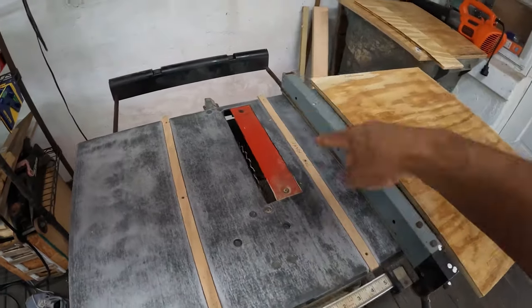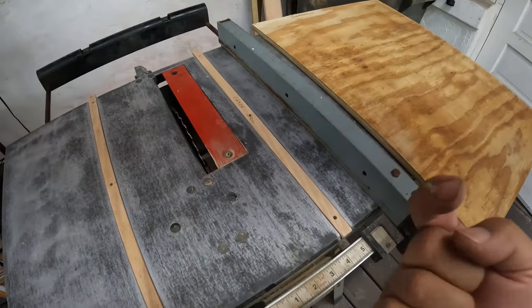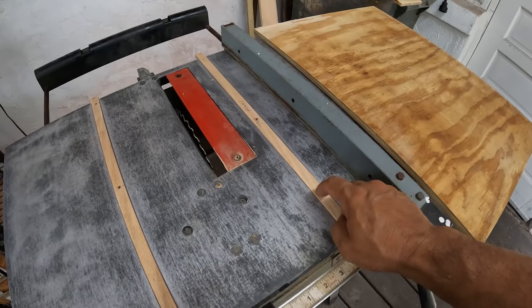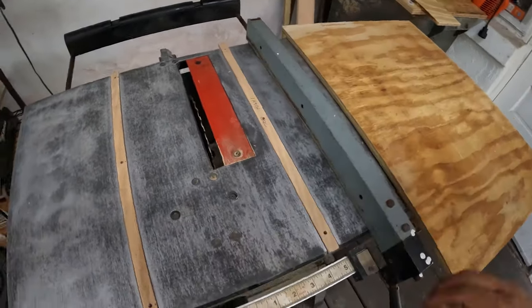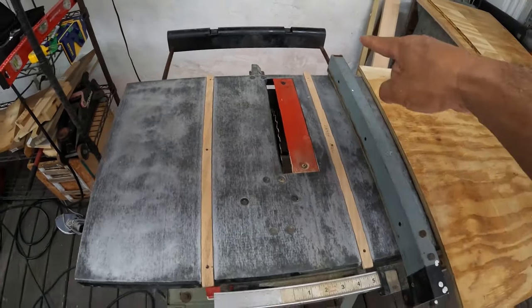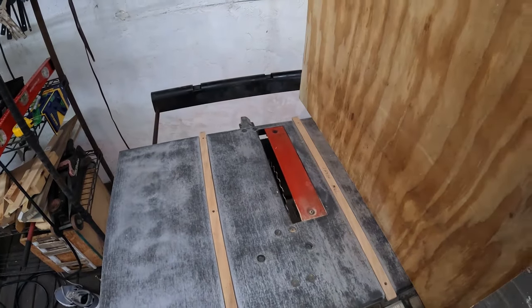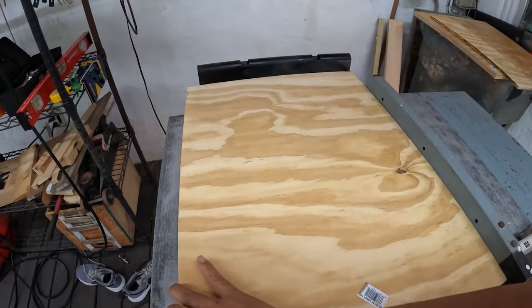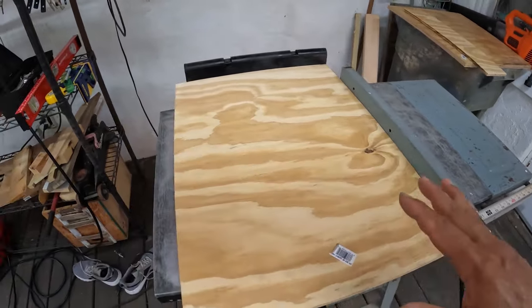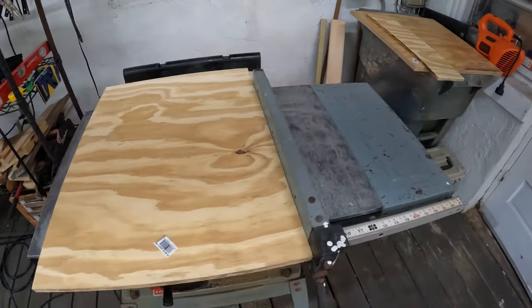So then I'm going to put glue. I went ahead and pre-drilled some holes here. So I'm going to put screws in there on top of the glue, but that'll keep this board from cracking when I tighten it down. I'm just gonna space them out evenly there. Put some glue on, and then just flip this board using that edge, and then just kind of dropping it on there, and then put some weight on there, and then get that glued down. And then the track holds it perfectly aligned, so it should be perfectly aligned. So let me do that next.